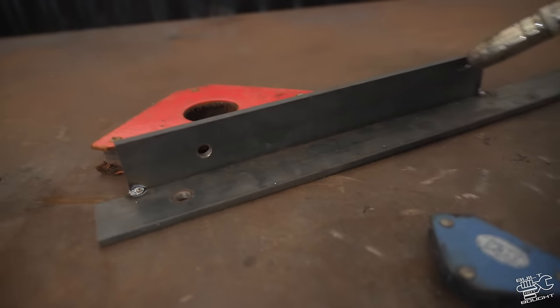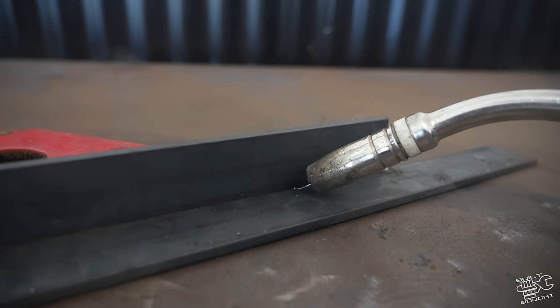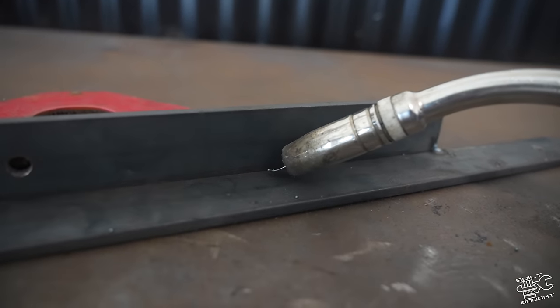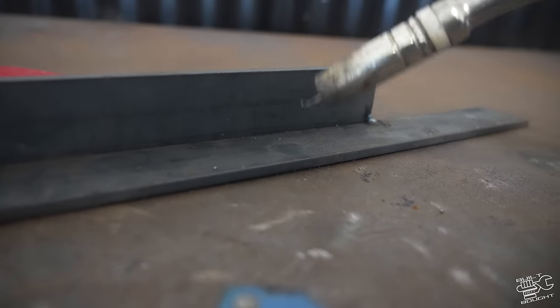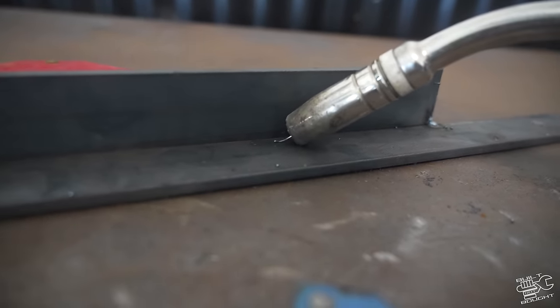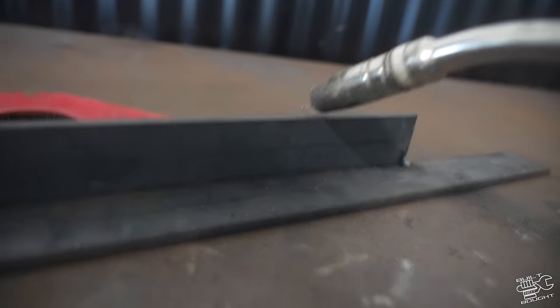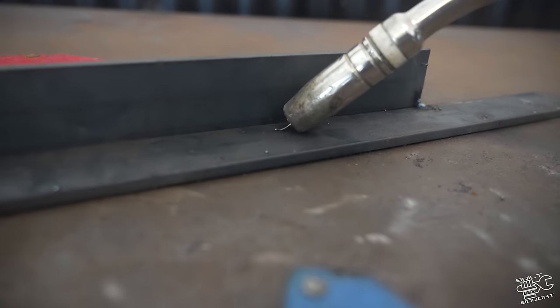This is where we get to the limit of my experience: how to weld and what technique to use. I still haven't fully worked it out myself but the way I've been doing it the last few years seems to work fine. There's the push-pull technique where as you go along you push up and pull back - you always want to push the molten metal puddle along with you to keep the heat in the job and get the penetration. For a larger gap, flat piece, or external weld you can go side to side, crisscrossing to really get the weld into both pieces. If you've got a thicker piece and a thinner piece, you can push the heat more into the thicker piece to get penetration without blowing through the thin one.